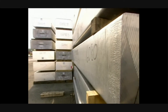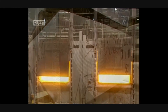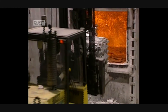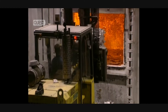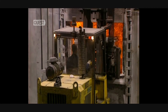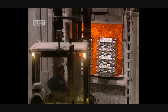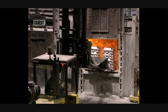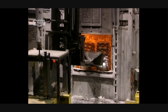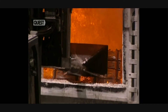The manufacture of aluminium foil requires the repeated thinning out of a large block of aluminium. This massive ingot's journey begins by being blasted in a natural gas furnace. It takes three to eight hours to melt this 27,000 kilo lump of aluminium. The re-melting furnace operates at a staggering 750 degrees centigrade. No chances are taken because the fusion temperature of aluminium is 660 degrees centigrade.